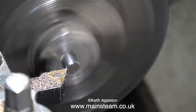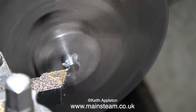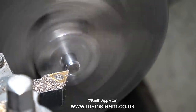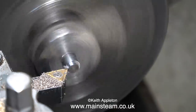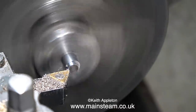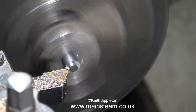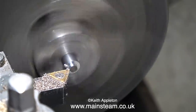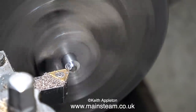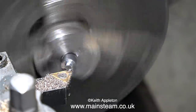So here's the part, held in the chuck by the very small bit at the end. I'm trying to avoid facing across the end which will put too much pressure on the piece. Instead I'm taking small cuts from right to left, which in theory will not put quite as much pressure on this small component. Don't forget this part is only held in the chuck by the very end part and that is very small. So far so good, but when I get near the middle — watch — the part comes loose in the chuck.